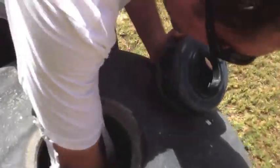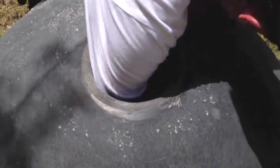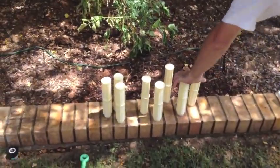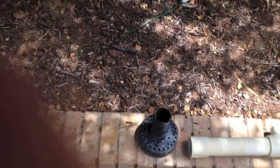When we assemble this, we're going to first put the hub on, then screw the laterals on once the hub is screwed on. We've got to make sure that before we screw on all the laterals, we turn that hub so it's facing downward and that the laterals are pointing outward in a lateral-type way — hence the name laterals. We hand-tighten that; we don't over-crank it. Once all the laterals are screwed on and in place, we come back and screw our top piece into the bulkhead, then screw our diffuser on, making sure that the air bleeder tube is passing through the diffuser and up into the lid.